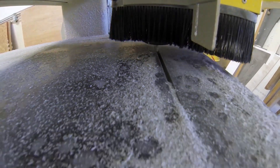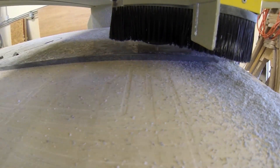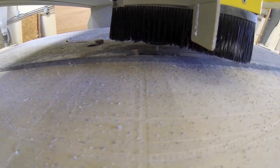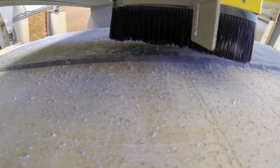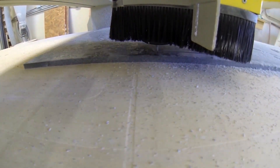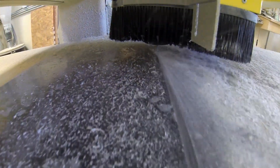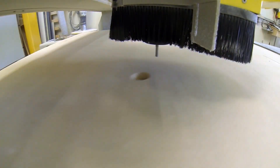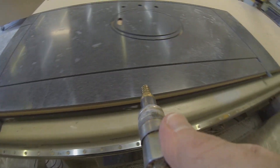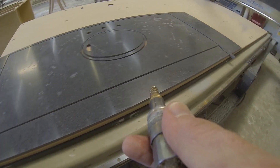By not moving, you're going to get the right shape. This is cutting out the final shape — nothing else is cut after this — and you can see it's not moving on the CNC because there's so much volume that it won't move. So that's the process of cutting a countertop on the CNC: inside pieces first, then move to the outside pieces. Thanks for watching everyone, please like and subscribe, and comment below if you have any questions.